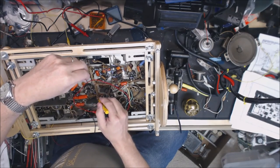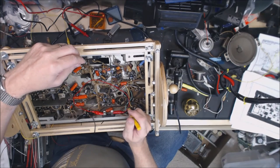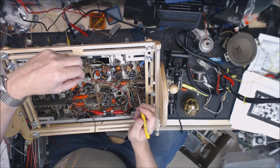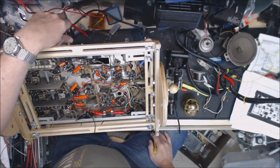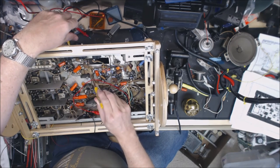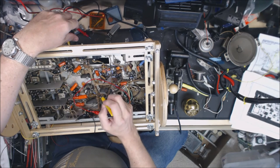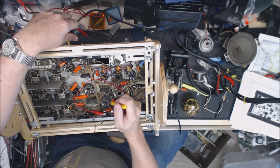And the voltage was way too high on the cathode here. I triple checked my wiring. I even had my son Brad, KD0JCP, come out one evening, and he went through it with me, and everything looked right. Very confusing. Finally, I punted. I shouldn't have waited so long. I got on one of the Hallicrafters Yahoo mailing lists and told people what we were doing, and a fellow by the name of Art on there pretty much diagnosed it. He said that this IF transformer must be shorted.